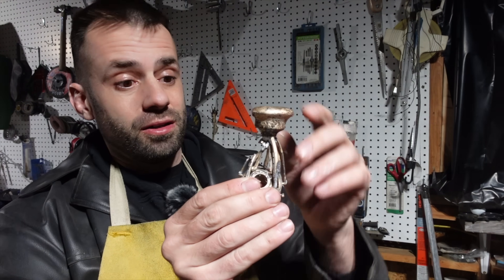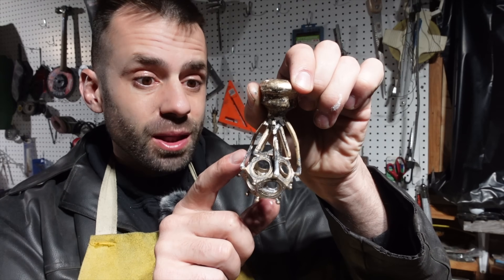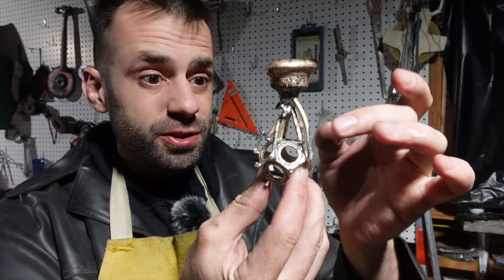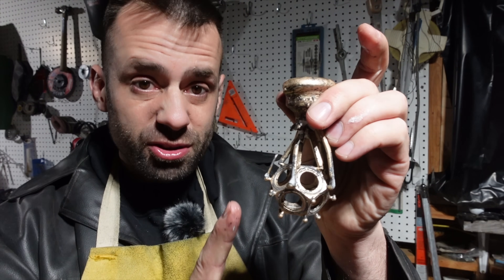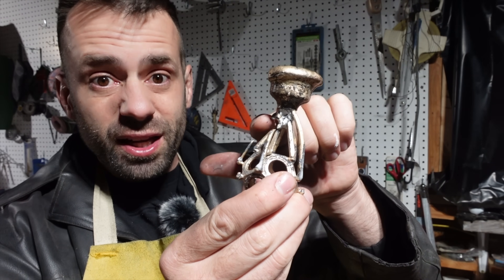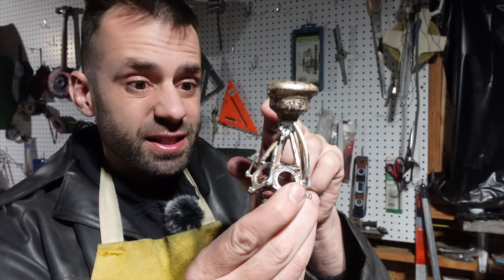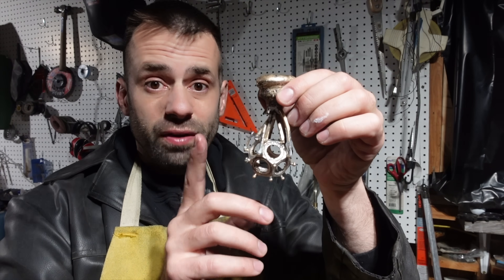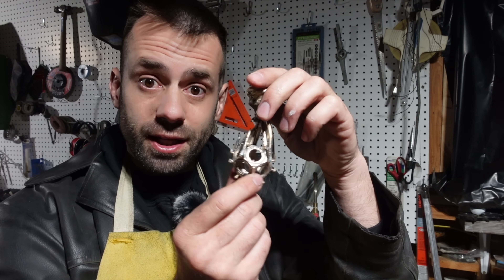Now there's one really interesting thing here. I had a bunch of sprues going down to these nubs, and you can see some of the nubs didn't connect all the way to the main riser. I'm thinking it's because it got full first from the central runners, and then these were where the air was escaping, but the metal started going up and didn't quite connect — it got vapor locked where it didn't have an escape and didn't have enough pressure to blow that out. If the vacuum was running, that probably would have been drawn out and full of metal. Every time you cast you learn something: if you're venting something, you don't want it to go out the same hole as you're pouring into. But we luckily got away with it.